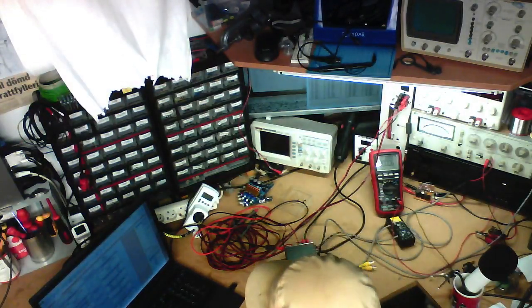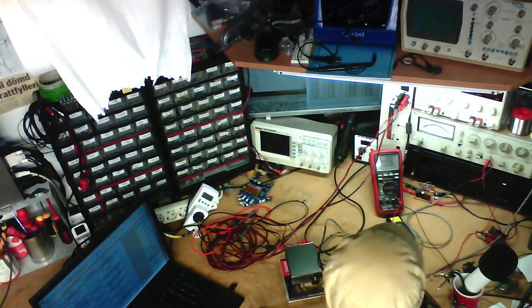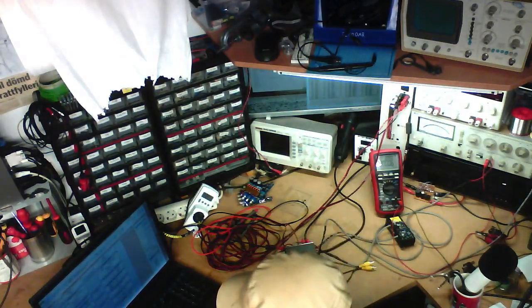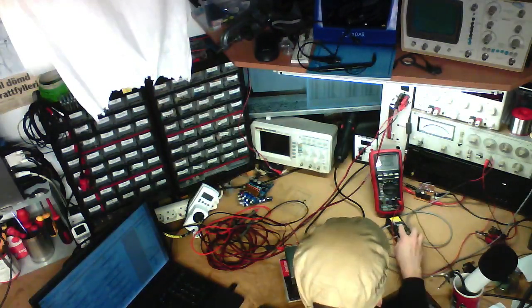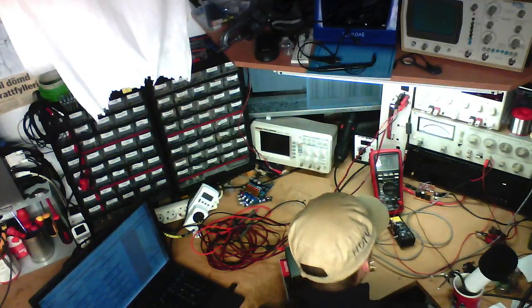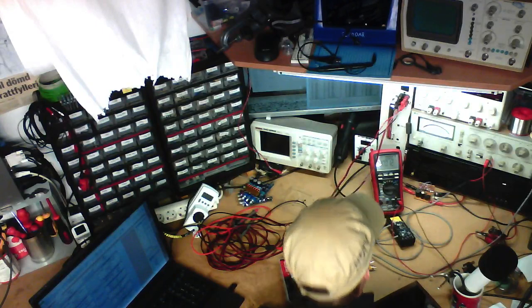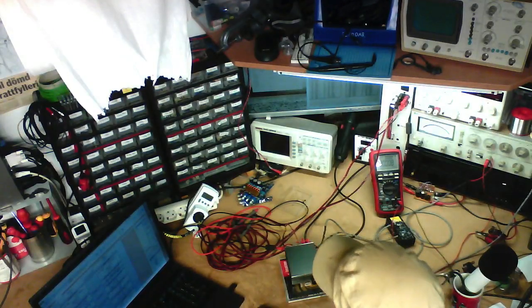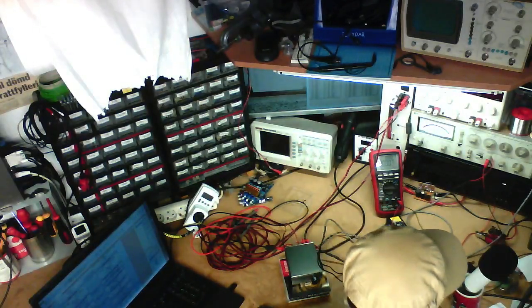Which is about the same level as the LePi, actually. Not hi-fi by any means. Very non-hi-fi. Let's do the same thing for right channel, just flick the switch. And we've got 220 microvolts. Or minus 73.15 decibel volts.